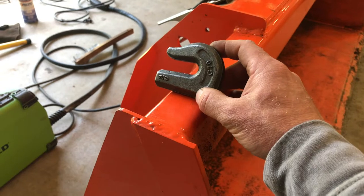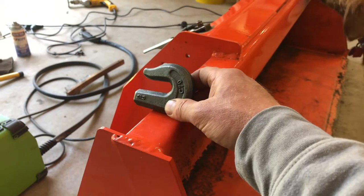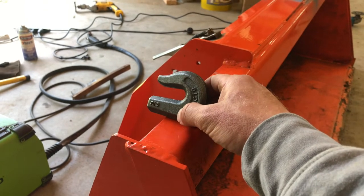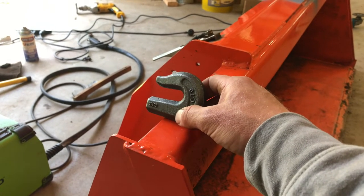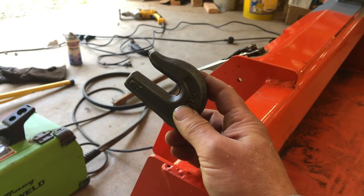Because I don't like the lack of bite with these hooks, I got three-eighths hooks that I'm gonna weld on here. For this bucket, I was worried that if I put too big of a hook on there, one of these days I'd go too big and end up doing some damage, so three-eighths would be sufficient.